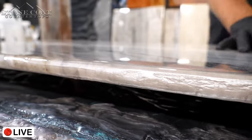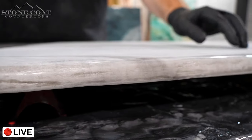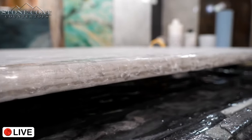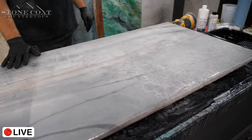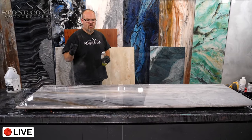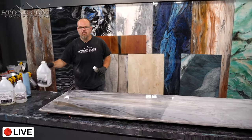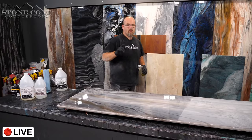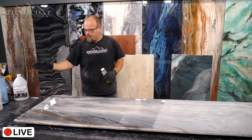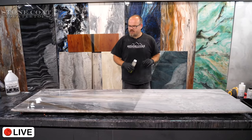Check out this rock-face edge — I like how that came out after it dried. The sanded area looks like this, but the top coat is going to wake that up. We've updated our website: you have a two-to-four hour recoat window. For anyone brand new to this, start with our original products — they have all the working time you could imagine, but not the benefit of getting a job done the same day like platinum allows.